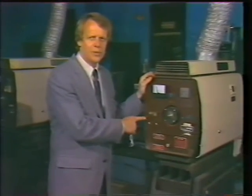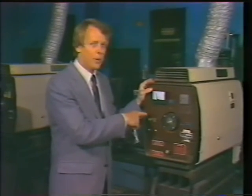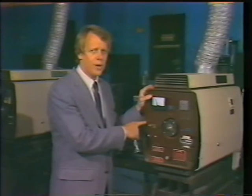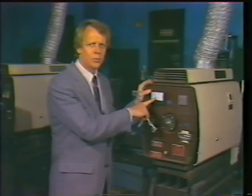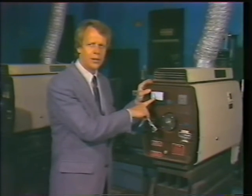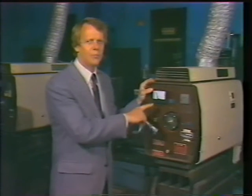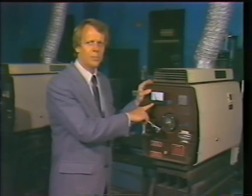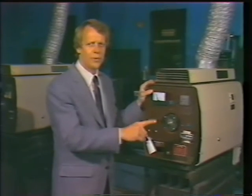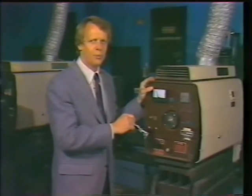This Xenon lamp source is typical of many upgraded theater operations. The bulb is designed to operate over a range of voltages and currents. If you're operating at less than full rated power now, you're in luck — you can increase the power and increase the light output for 3D features. If you're running at the limit now, you might consider putting a higher rated bulb in. You can turn it up for 3D and turn it down to gain longer lamp operating life.